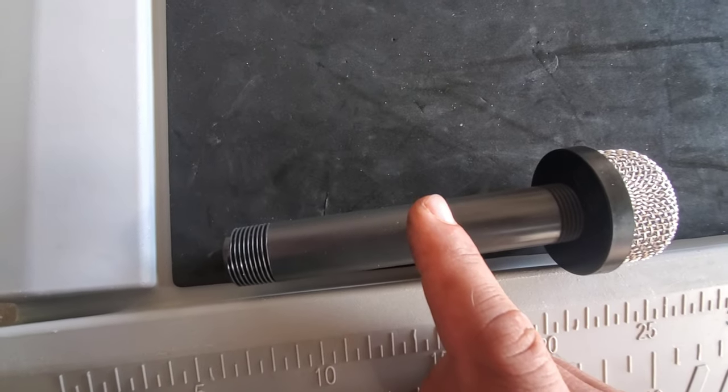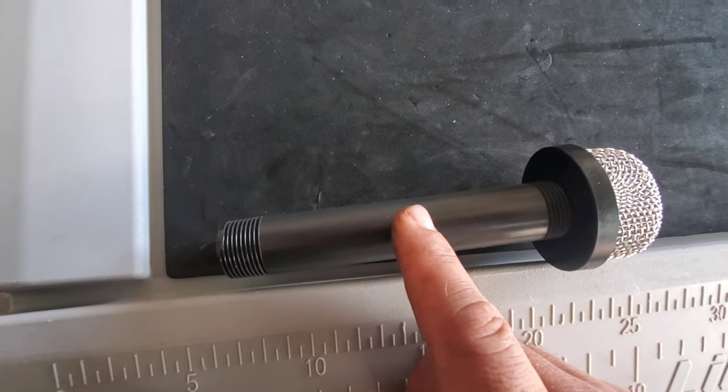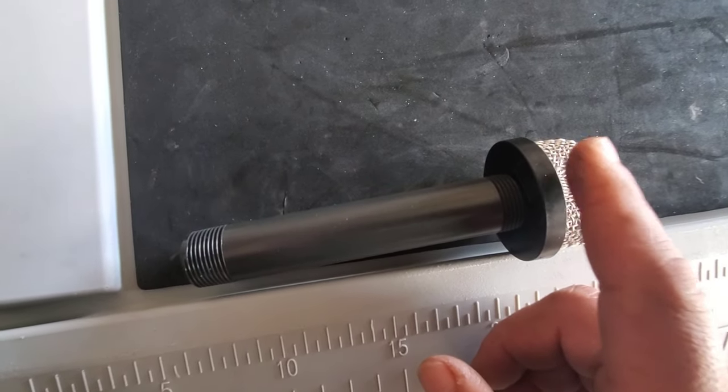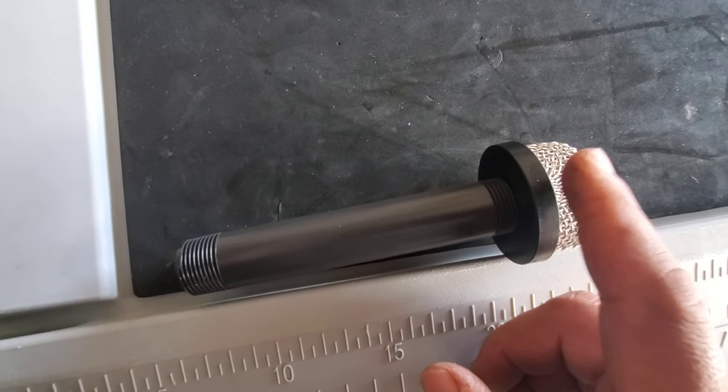Again, from wall to wall, outside to outside, it's two and three quarters. So don't tighten this one all the way up. Tighten it up, then back it up two full turns, so that way you have enough room. When you tighten it, it'll seal properly.